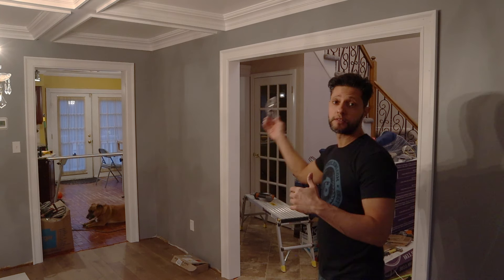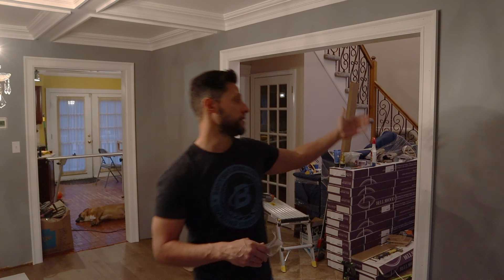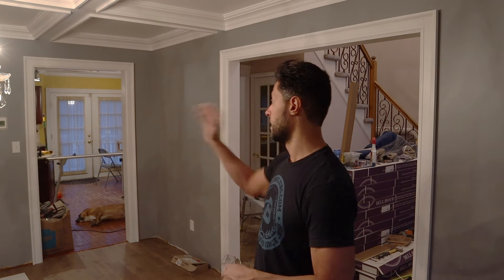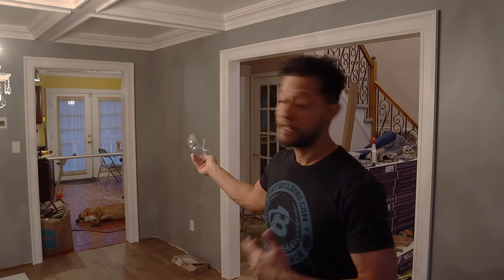Another room down — you probably saw the photos on Instagram. Alright guys, that's it for this video. I hope you enjoyed it and got something out of it. I hope you learned how to pre-assemble the casing and install it. If you don't have door jamb material — which is just three-quarter inch pre-primed pine — and you're redoing existing moldings, you most likely already have solid wood casings. You can cheat with sheetrock painted white, but it doesn't look as good. If you have a small opening don't do it because you'll make it even tighter, but with a large opening like this 40-inch wide door it's fine — you're still at 38 and a half inches, which is still oversized. Make sure you hit subscribe and the notification bell, and check the description box below for links to the tools I use. I'll see you next time.